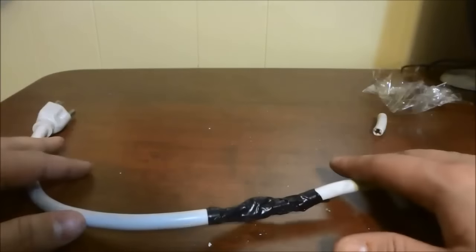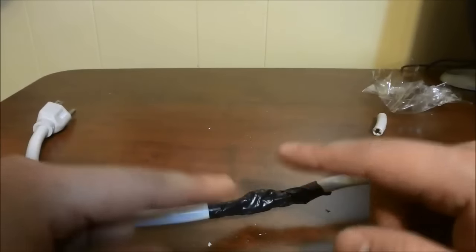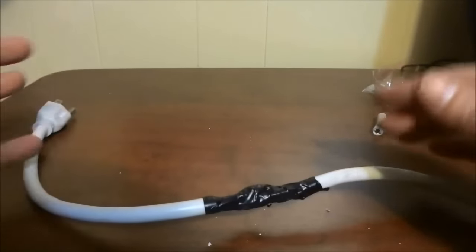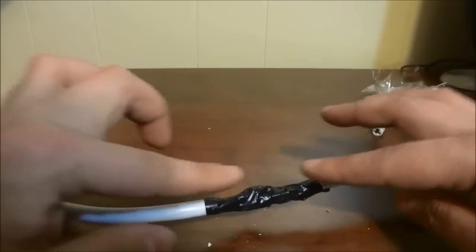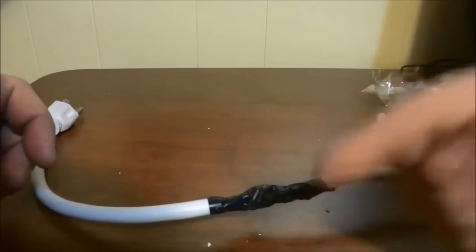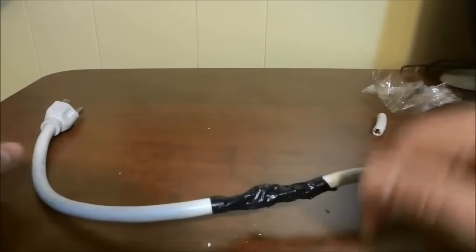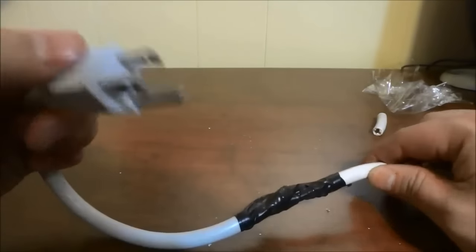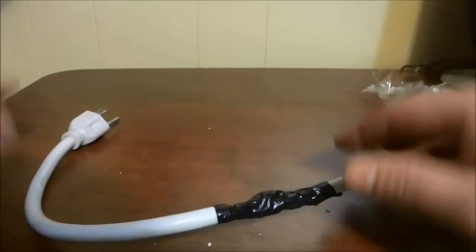So there you have it — I have shown you how to fix a broken power cord. We started off by cutting out the area that was damaged, then we removed the outermost insulation on both sides of the cord, and then we removed the inner insulation on the three wires coming out from each side. We then connected the wires and matched the colors, taped over each of the wires individually, and taped over the entire area. Just for clarification, I used electrical tape throughout, and this is specifically for power cords with three prongs. That's all I have for you today — thanks for watching.